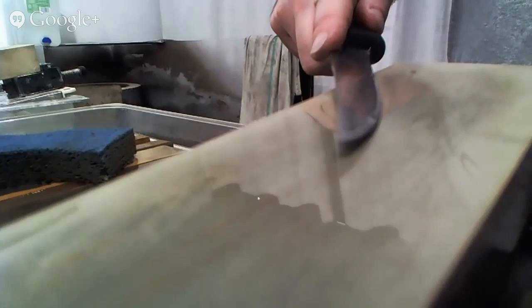Here you can see our normal sharpening angle, and what we need to do is reach the tip somehow. So as we lift up, we're slowly getting there, but you can see that the tip is still kind of not touching, and it's because we haven't rotated back. So we lift up and rotate back. Now, just rotating back means that you're just lowering the angle, and just lifting up actually makes it a less acute angle towards the tip. So it's a combination of lifting up and rotating back as we follow through. Kind of looks something like that. I hope that this makes sense and comes through in the video.